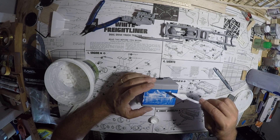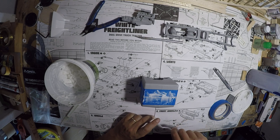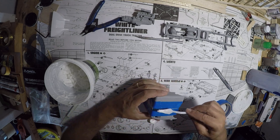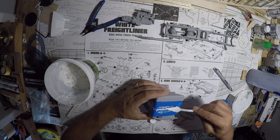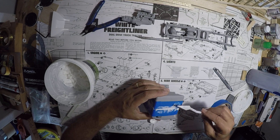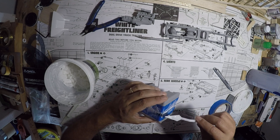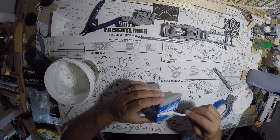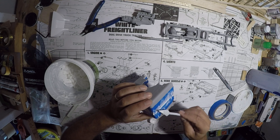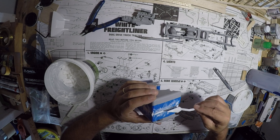When it hardens, it's shrink-free — so it should ride high and cover the seam even as I'm sanding. I want this to be kind of like a heavy paste, and then just get it solidly into that gap. As you're working it around, you'll be able to see if there are any low spots.